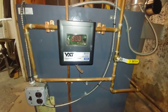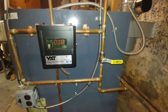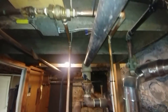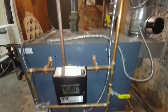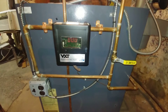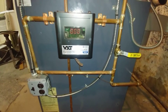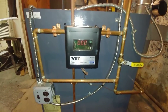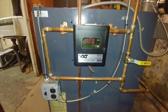The VXT is mounted on the side of the boiler — there's your bypass and there's your backflow preventer. I would have liked to have seen the VXT mounted higher so I don't have to crouch down to read the numbers; otherwise it tends to get forgotten about and ignored. You don't want to do that.